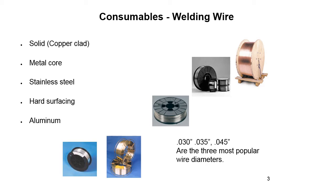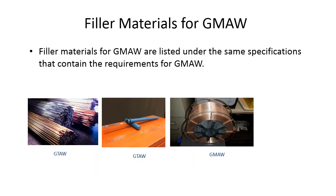And this form of the welding filler metal does not conduct an electrical current. If the wire is used in an electrical circuit, it is called a welding electrode and is defined as a component of the welding circuit through which current is conducted. A bare electrode is normally a wire, however, it can take other forms. And then we're going to touch base real quick on metal core arc welding. I didn't delve into this just because it's a whole other universe unto itself.